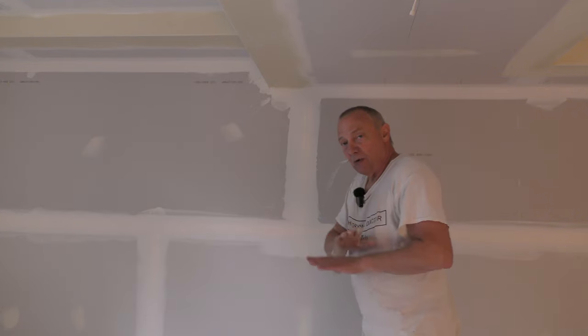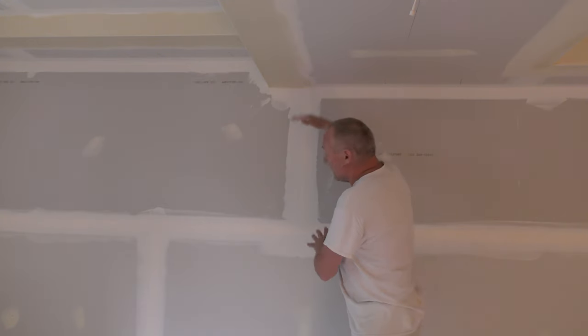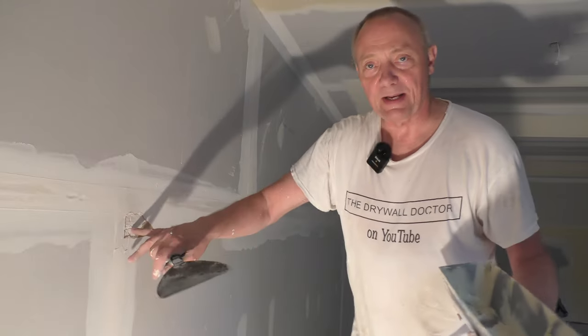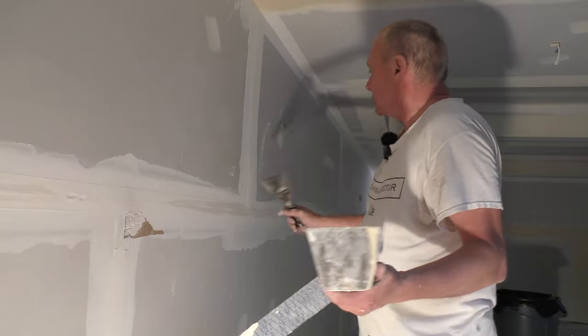I will still finish this in two coats — two more coats and it'll be ready to sand. On this corner bead I've only got one coat, I've got one coat on these screws. I'll coat this out today and show you how I cross off my butt joints. Then when it's dry I'll come back and skim it, and when that's dry I'll come back and sand it and detail it — then it's ready for paint. I know a lot of you think I'm staging all of this, but I don't. What you see is what I'm doing.